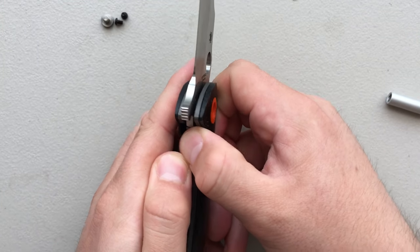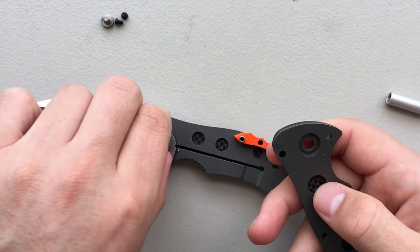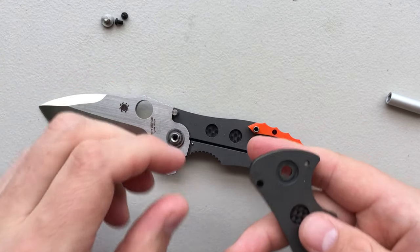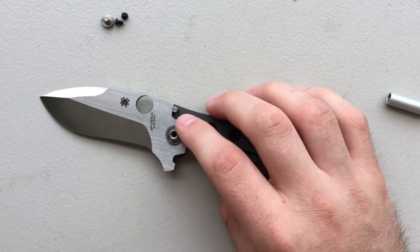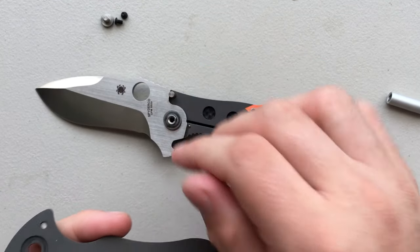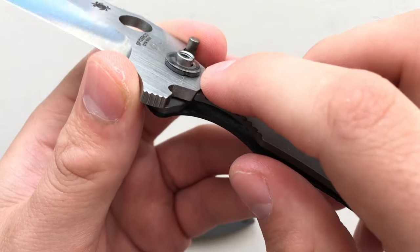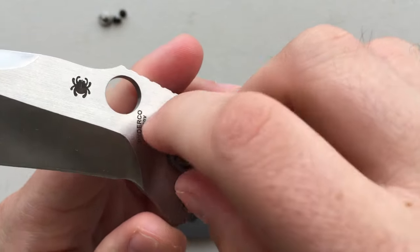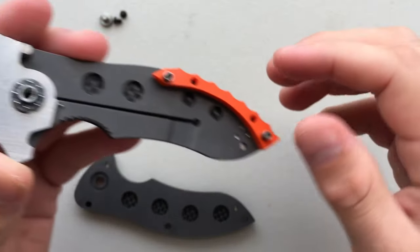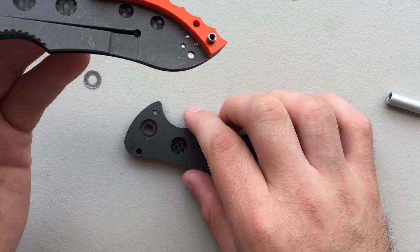I'm being a little ginger with this guy because — oh, perfect. That's beautiful. Neat. Alright. Immediately one thing I can see is that there is a fair amount of wear on the back side of this little washer. If we take a look up close, what we've got is a steel bearing race that the bearings rotate against, as well as a set of captive bearings. I need to make sure that that race goes in properly.